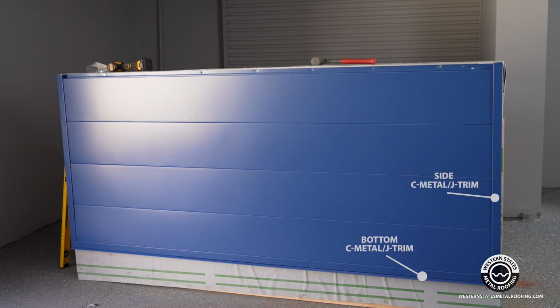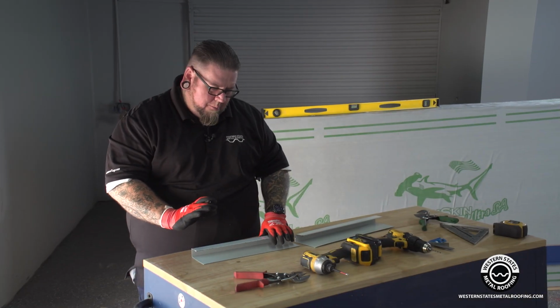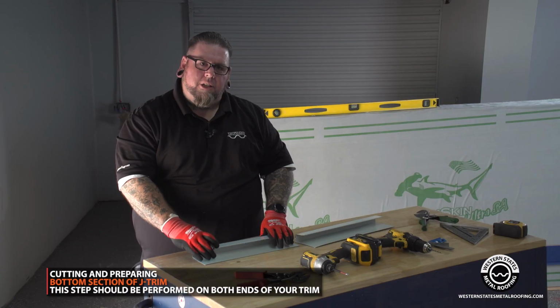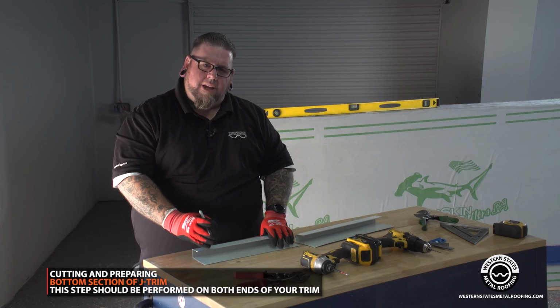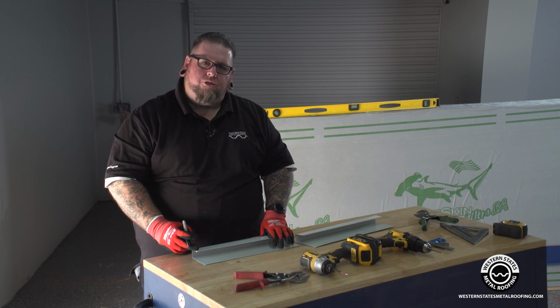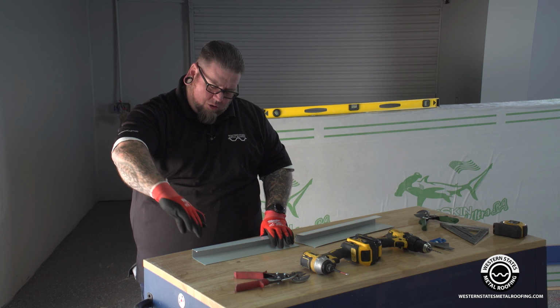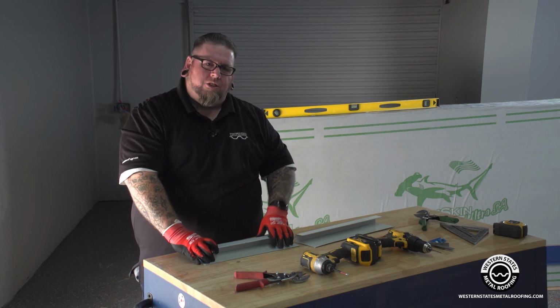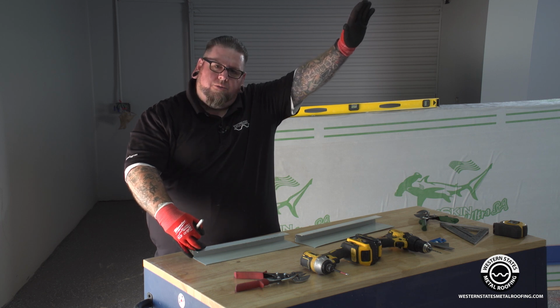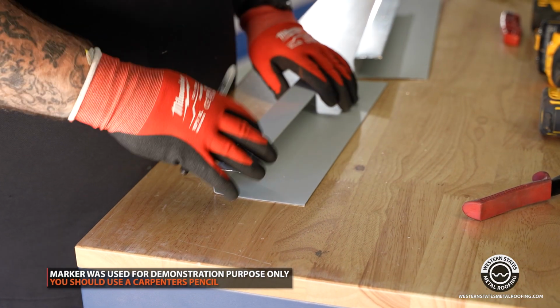So what we're first going to do is draw the bottom piece where it's the tab connecting to the piece sliding into it. And typically when you do an install, you want the tab to be on the building so that if you're having to put caulking or whatever on the end of the trim piece, you slide the piece over and into it. That way it's easier. So when you're on the side of the building, you can hang it by sliding it into the groove and then going next to it and putting your fasteners in it, and it will help you on the job site.